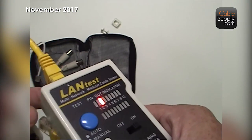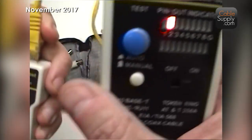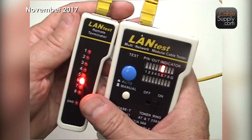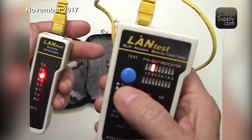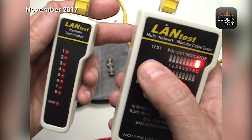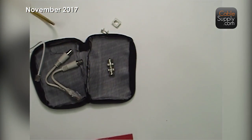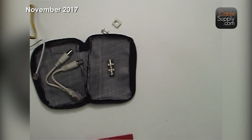You plug it into the jack and it goes through the different wires. The other person watches to make sure there are no problems. You can talk on radio: wire one — you got a light? Yes. Two, three, four, five, six, seven, eight. If both ends are red, you know you have continuity. Continuity is the first basic test in a cabling job, from the patch panel through the wall. Even if just one wire is broken, it will let you know — that's pretty ingenious.